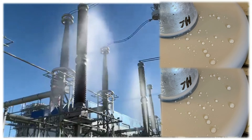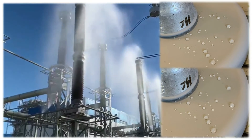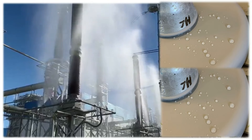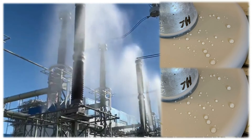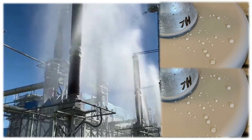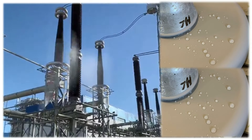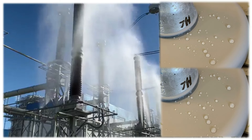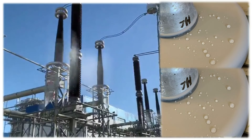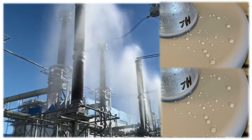Here you can see another option: washing for polluted glass and ceramic insulators — a live-line insulator jet washing system. Live-line insulator jet washing facilities shall be installed on critical power lines, power plants, and distribution substations located in climatic and remote areas with high temperatures, humidity, dense fog, and short rainy seasons that do not allow for natural washing, and dry weather periods followed by fog, mist, and light rain. When the polluted insulators become wet, a conductive layer forms on the contaminated insulator surface, initiating leakage current, insulator failure, and degradation. Contamination failures usually occur during high humidity or the beginning of the rainy season.